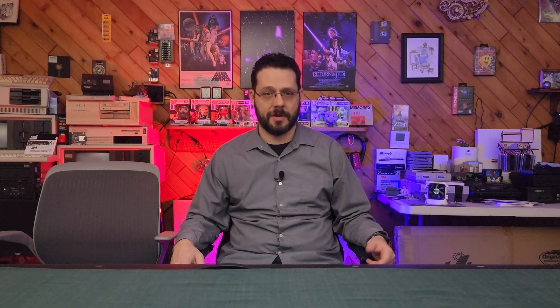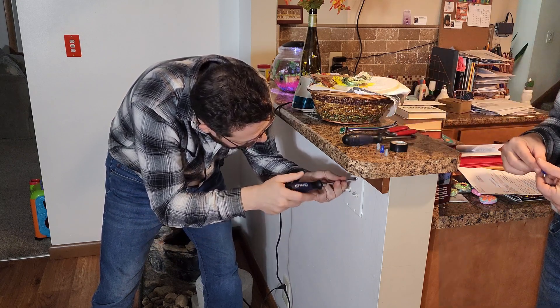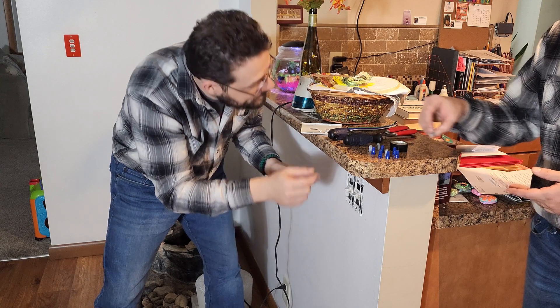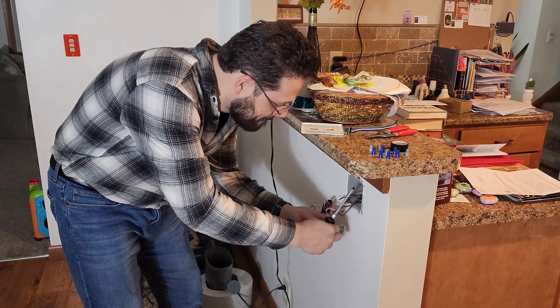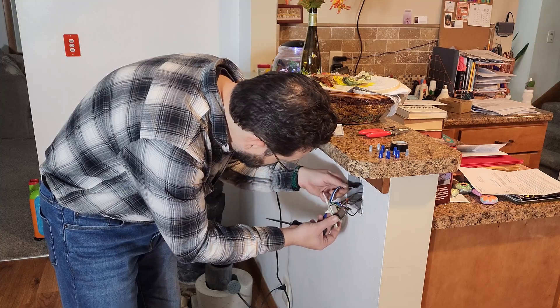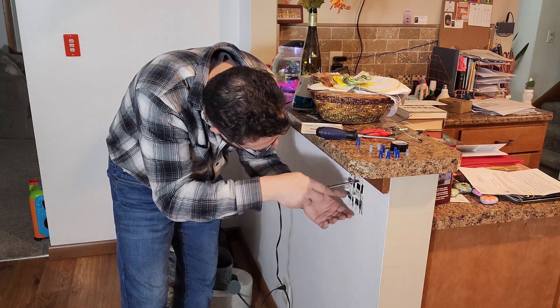The transmitter can be wired to any 3 to 24 volt source — you low voltage folks should pay attention to this part — and the input pin should be wired to a button and back to the ground pin. We're using old low voltage switches for demonstration here, but you could get as fancy as you like. Just make sure you protect the transmitter from coming into contact with any metal accidentally. The transmitter will fit nicely in a lot of very tight spaces, even with a battery pack. If you have access to DC voltage where you put the transmitter, all the better, because you won't have to worry about charging or changing batteries.